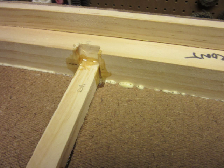One more thought on this. Besides providing just reinforcement, these wooden sticks or little pieces of plywood for the latches should be epoxied or otherwise glued to the masonite as well as on the ends where they meet the stringers. But another function of these strips and pieces of plywood is to provide an adequate place for wood screws to go into when you're mounting the hardware. Otherwise, you're just screwing into the masonite, and masonite will not take a screw. It will strip out right away. Basically, the screw is just going to go through the hardware, through the masonite, and then actually go into the wooden strips or little plywood inserts.